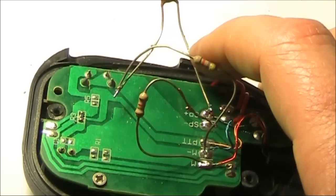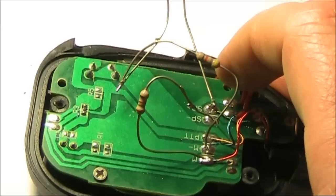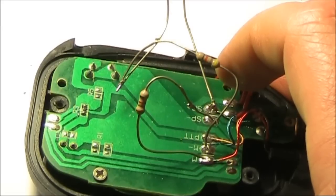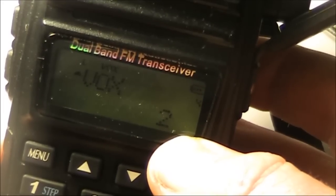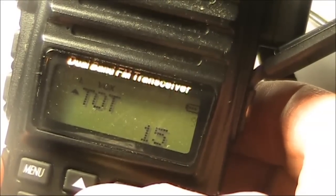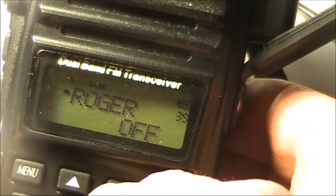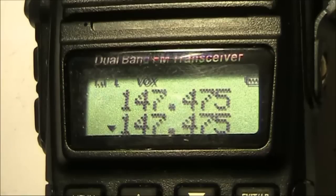When audio comes up on the received frequency, it sends some audio to the transmitter and there's enough time for the transmitter to be triggered for a short time. This of course is when the transceiver is set to VOX. I've got it on a position of 2. I also suggest putting the timeout timer on the shortest period available, 15 seconds in this case. The Roger beep should be set to off, otherwise the thing has feedback and keeps transmitting and beeping. I've set the volume control to nearly maximum on the receiver.